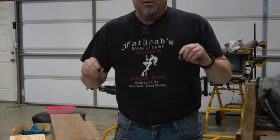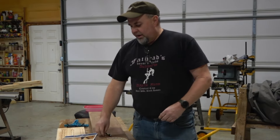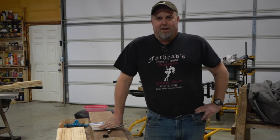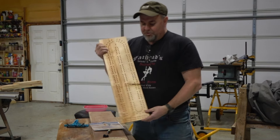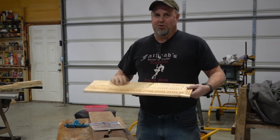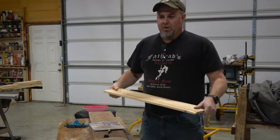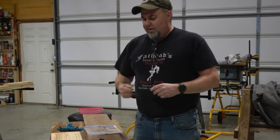It's also got a couple of pins — you pin these jigs in as you're drilling the holes. The nice thing is I do have a drill press, though I don't think you need one to use this kit. Before I ruined some good wood, I tried this out on some pine scrap I had sitting around. That was my very first attempt done with a 1x8, and it worked great with one exception. This drill bit is really designed for hardwoods — it tears out all through the pine and there's no way of getting around that. So absolutely, if you're going to be building a cribbage board using this jig, you're not going to be using any softwoods.